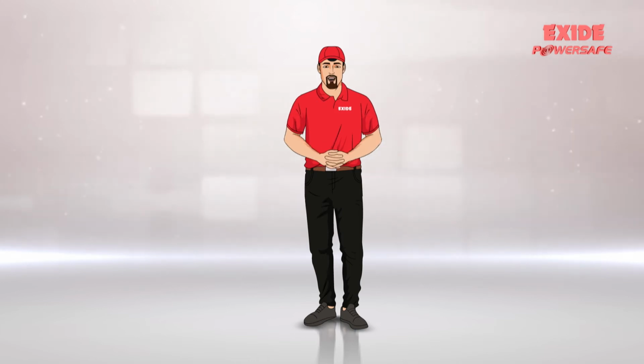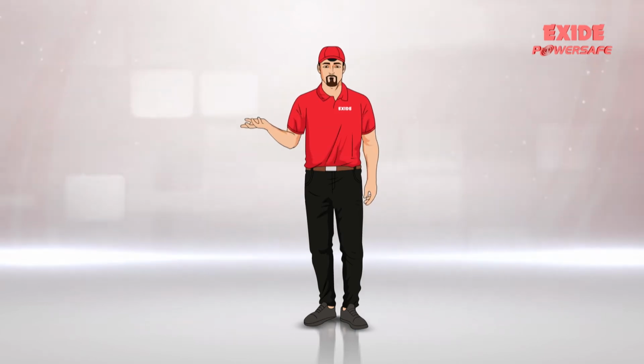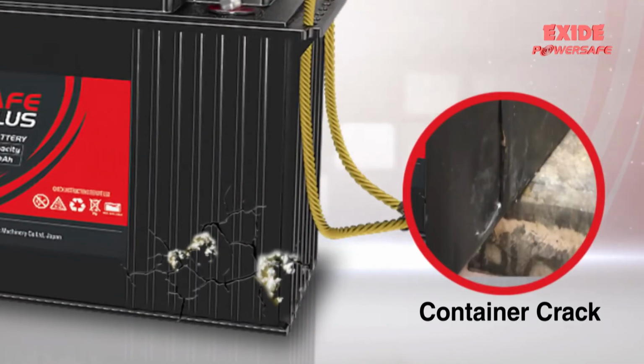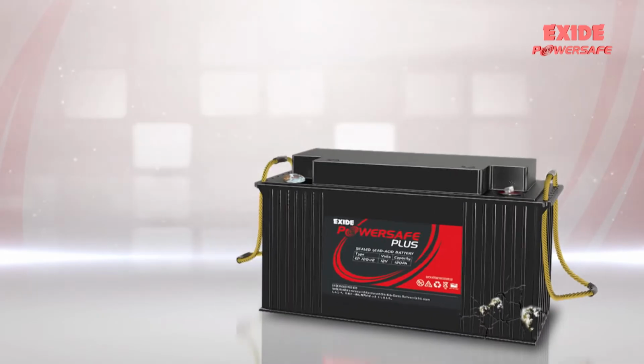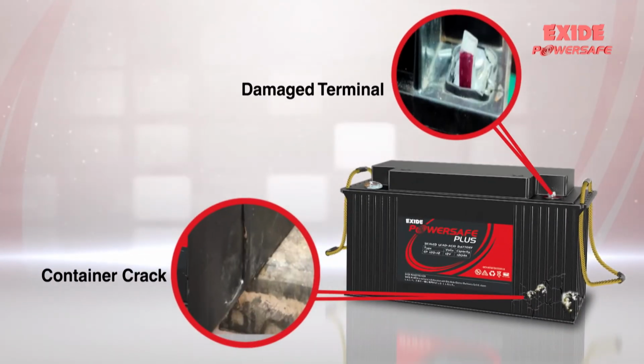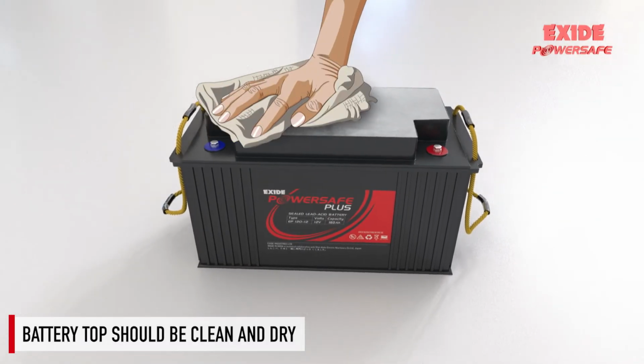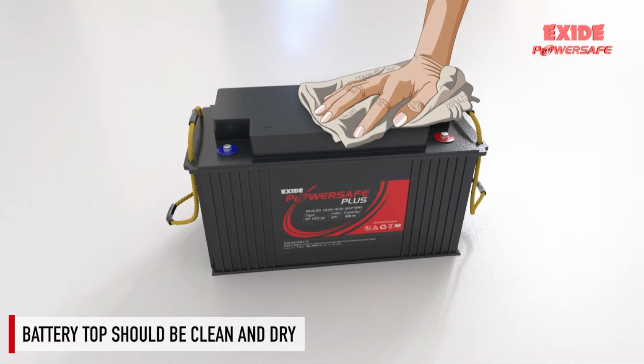Post-unloading and during unpacking the batteries at site, one needs to check all batteries for visible defects such as cracked containers, damaged terminal posts or other unrepairable problems. If any of these defects are found, please contact Exide service. The battery top should be clean, dry and free of dust to prevent blockage of the vent holes.